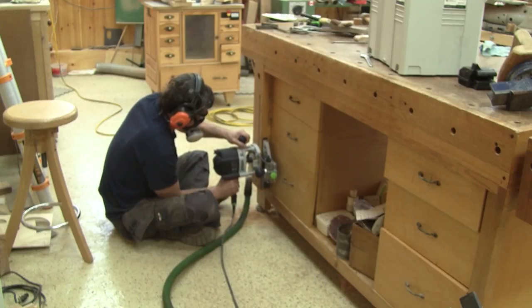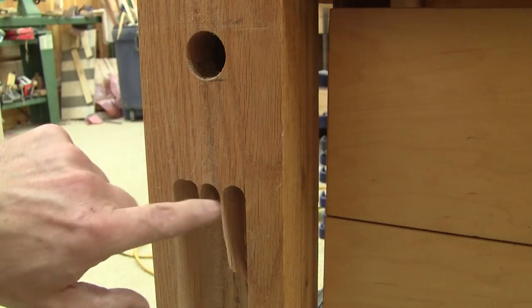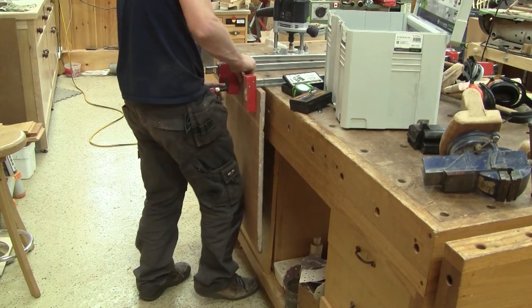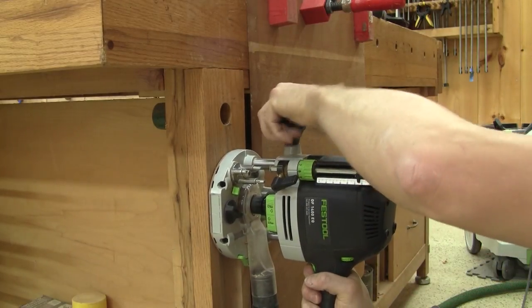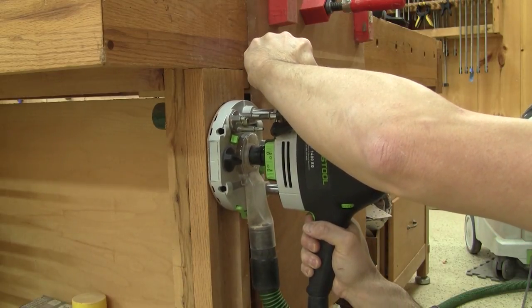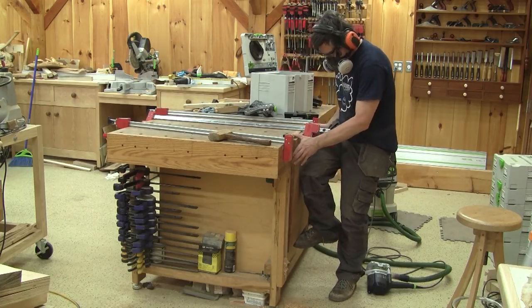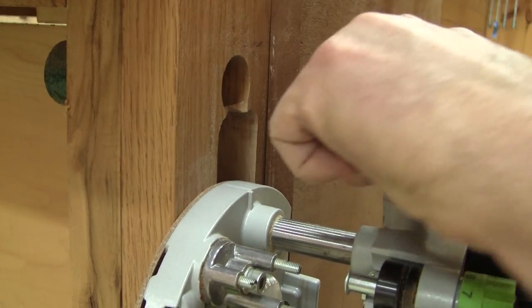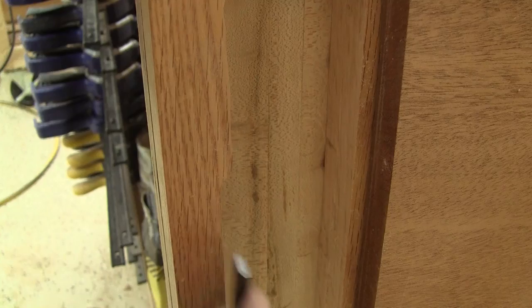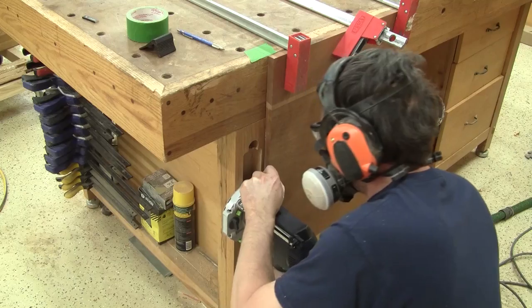First pass is done — I still need to make several more. Since I reference a router fence on this side of the leg, I can't cut up to my line. So I clamp a square piece of wood onto the workbench, use its straight edge to guide the router, and cut what I didn't cut before. After each cut, I move the piece a bit and repeat. In the end, I just have a small sliver of wood to remove, so using a setup block, I figure what I need to remove, move the panel that distance, and finish the recess.